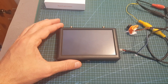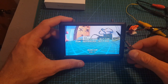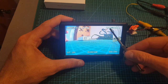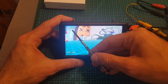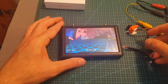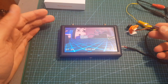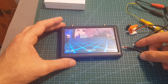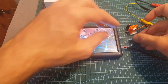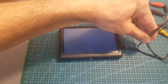After turning on the camera, you're going to see an indication for the current control mode. Over here, you can see that now it shows joystick control. We can see the preset for the picture and the TV format. In order to switch between the modes, you will need to power up the camera while pressing the selector tool. I don't have it since it wasn't sent to me along with the camera, but basically what it does is just short between the RX and TX pads.